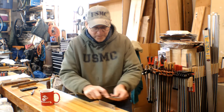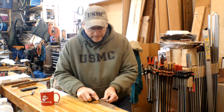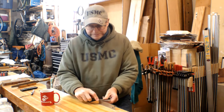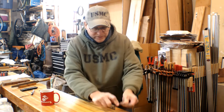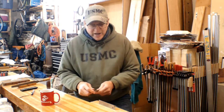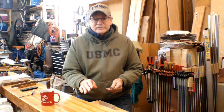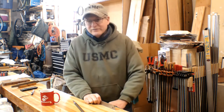Five to ten times. Be careful with these corners — if I cut the pad of my thumb on this corner, yeah, that would be bleeding. A few passes like this and you can feel when the file finally hits its stride and is actually cutting the entire length. By that time you've gotten off all the work-hardened material and taken the crown down. It doesn't take that much — you're only taking off a few thousandths of an inch.